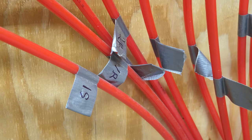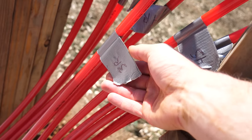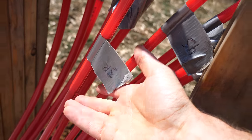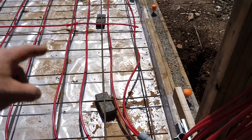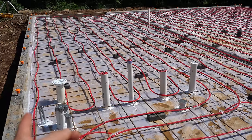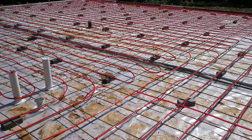Before cutting the tube I made sure my supply and return labels were still intact — that would not be fun to cut off. Circuits one through six each have supplies and returns labeled with R's and S's. Circuits one through three have the supply as the run closer to the edge, while four, five, and six it's the left. The hotter supply is closer to the edge because the slab loses most of its heat at the perimeter. The same principle follows for traditional ducted HVAC — you want supplies around windows and the perimeter where heat is being lost.